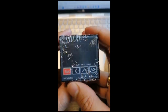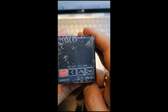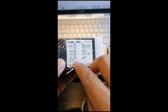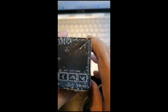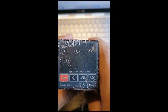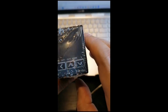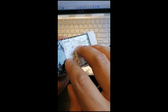And then when you are going to do that, you have to provide your external power, which is 24 volts, which you are going to directly connect the negative supply to the negative of your controller, which is terminal number 3. And then the positive of your power supply, you are going to connect this one to the positive input of your transmitter, and the output of the transmitter is going to go here on terminal number 5. So when you power up, your transmitter is like loop powered, connected into a loop, going here.